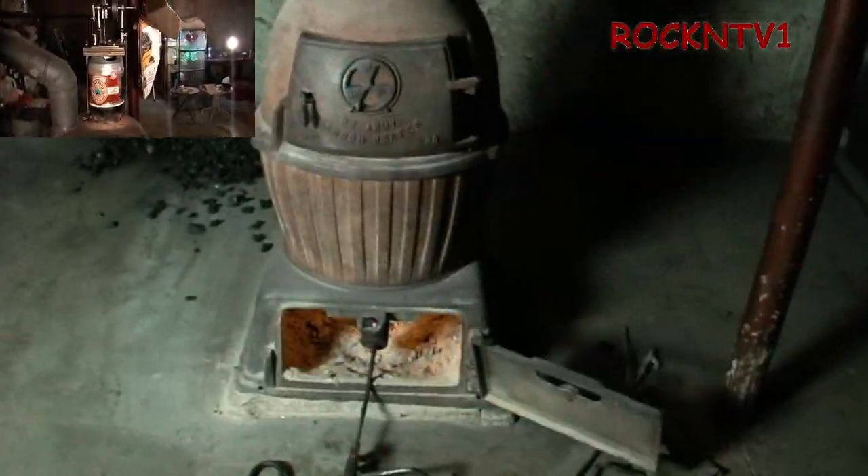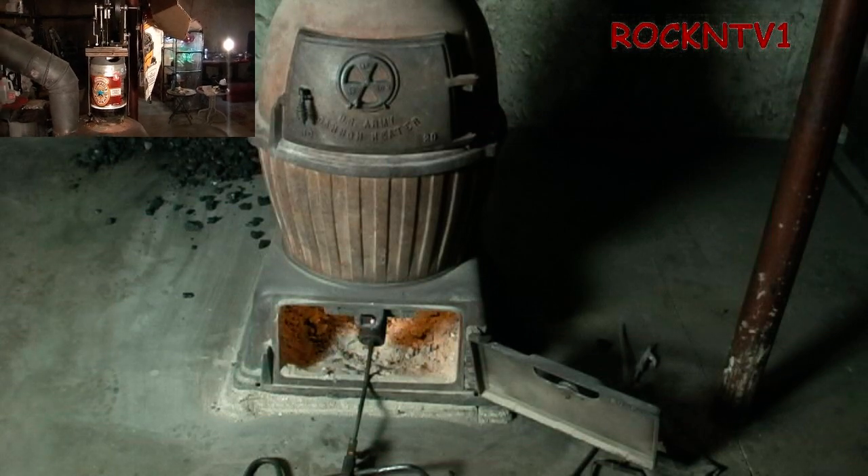You're not going to see too much in there but you can see a little bit. You don't want to see fire coming through the bottom — if you've got fire coming up through the bottom it's actually going to take longer to start. That's why we left the ashes around the side: it's forcing the heat and the fire to breathe through that coal stack.